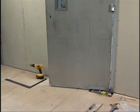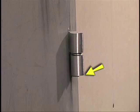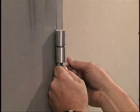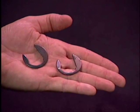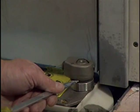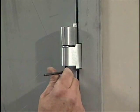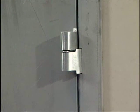Allow the door to close. All of the weight should be resting on the bottom arm. To ensure this, we utilize the intermediate pivot. First, remove the cap on the intermediate pivot — there is an Allen screw inside the pivot, and turning this screw raises the door. Two 1/16th inch C-shims are provided; fill the gap between the arm and spindle washer with one or both. The flat inner edge of the shim should contact the flat side of the spindle. Tap the shim into place underneath the closer arm. Relieve the weight from the intermediate pivot by turning the adjusting screw counter-clockwise to lower the door to rest on the closer. This is very important because the weight of the door needs to be on the closer, not on the intermediate pivot and jamb. Replace the pivot cap.